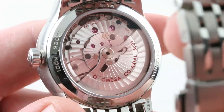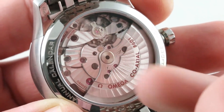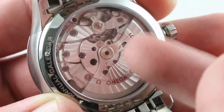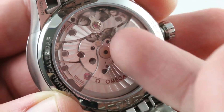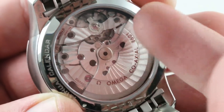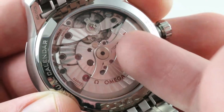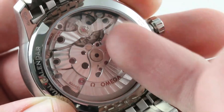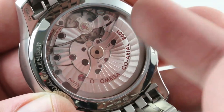Turn it all over and you can see that this is the Omega Caliber 8601. Based on the Omega 8500 family, the 8601 is the 8500 with an annual calendar. 60-hour power reserve, twin mainspring barrels, COSC chronometer, tri-level tangential escapement known as the coaxial. The 8500s were designed from the base plate up as purpose-built rather than converted coaxials, so they give you Rolex levels of toughness with the timing stability, reduced maintenance requirements, and outright precision that the inventor George Daniels originally promised.